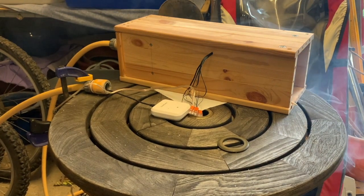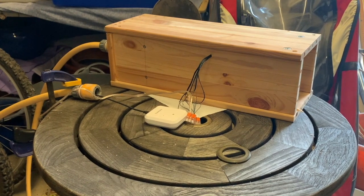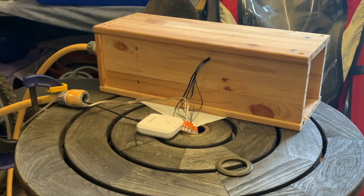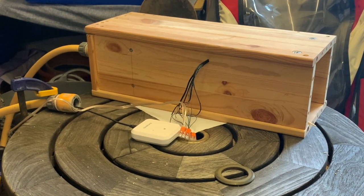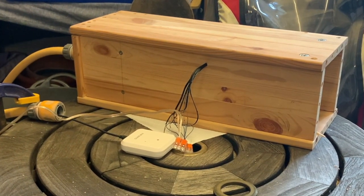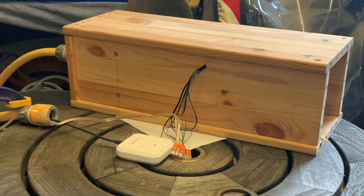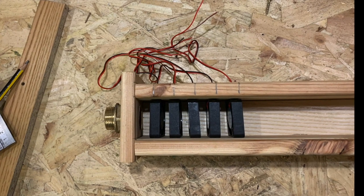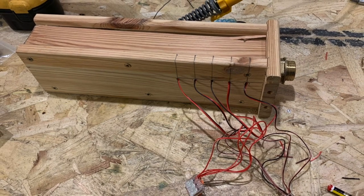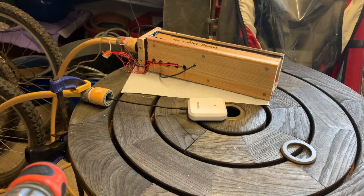Like all sorts of engineering, you always start out thinking that big is probably better. In this clip I've sped up a smoke match we put inside the fan box — you can see the smoke being pulled into the system, but we have to wait quite a long time. In this time-lapse it's around about a minute before we see a tiny amount of smoke trickling back through on the left hand side. So the big fan box was pretty rubbish.